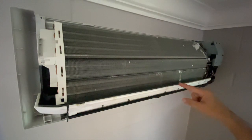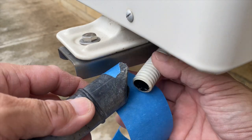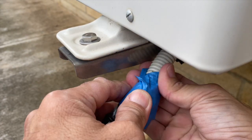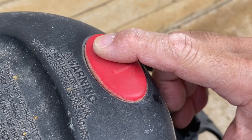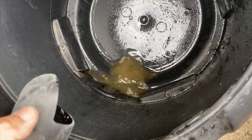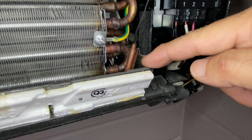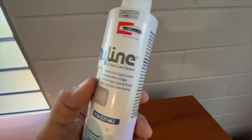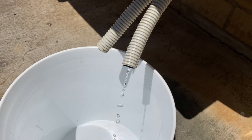Next came the drain pan with the drain on the right end. After cleaning the outside condenser unit the other day, I used a shop vac to vacuum the drain line. The drain pan slopes from the left to the right, and I used this New Line AC drain cleaner by pouring it into the left end of the drain pan, which flowed to the drain on the right end, down the drain, and out to a bucket. Please keep your pets from drinking the cleaner.